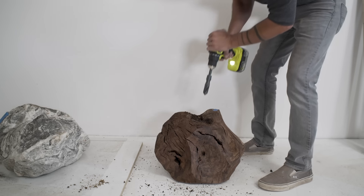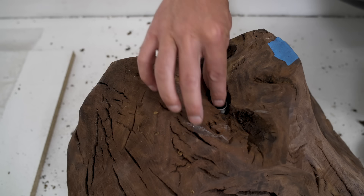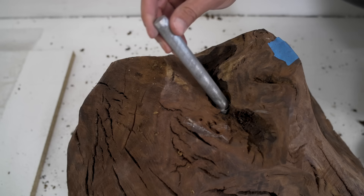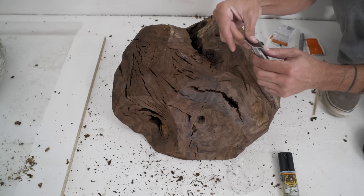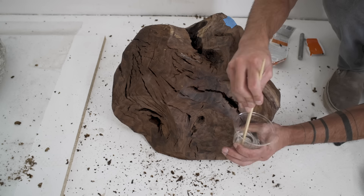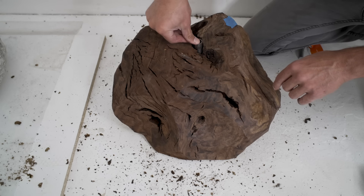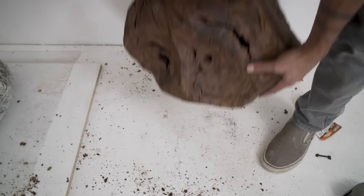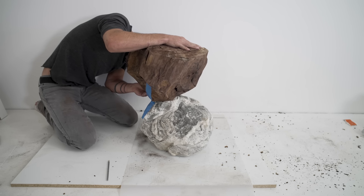Now I'm going to go up to a bigger drill bit. I can put my metal socket—just a piece of pipe—right in there, and then this pin will go into the rock. I'll seal off the end of the pipe so epoxy doesn't get inside. I could use the quick anchoring epoxy here—it does pretty well with wood to metal—but I prefer a thinner epoxy for wood when the hole diameter is close to the pipe, since with the thicker stuff and these tight parameters I'd get air bubbles.